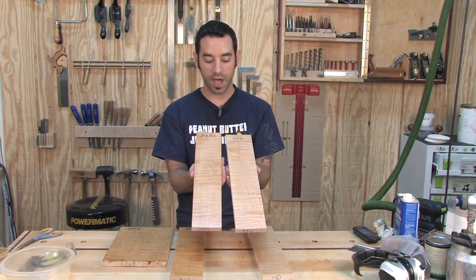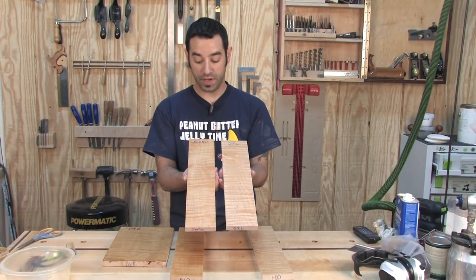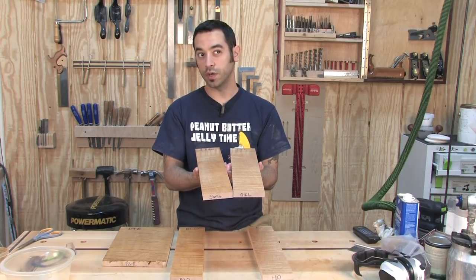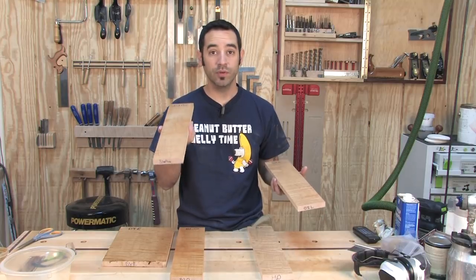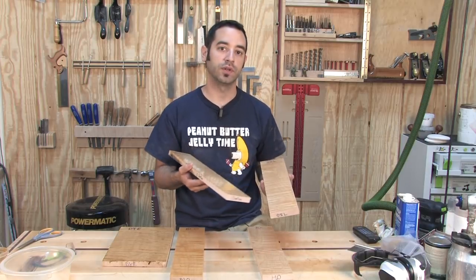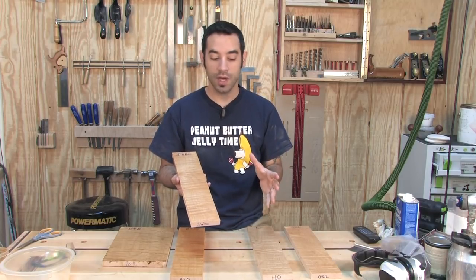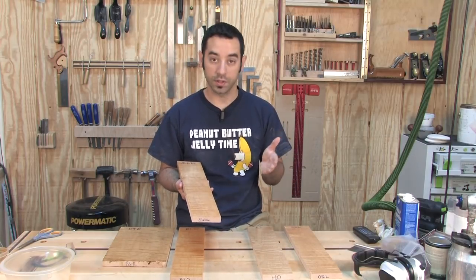The orange shellac from the Hawk Company was fantastic — I think it turned out great and is probably the closest match to the oil finish. And it's only a two-step process: a pre-coat of shellac and then your water-based coat. Almost all my projects get a wash coat of de-waxed shellac anyway, because if there are any surface impurities not visible to the naked eye, it's a good idea to have that shellac on there. It acts as a light sanding sealer and a great base coat for lacquer, oil-based, or water-based finishes.